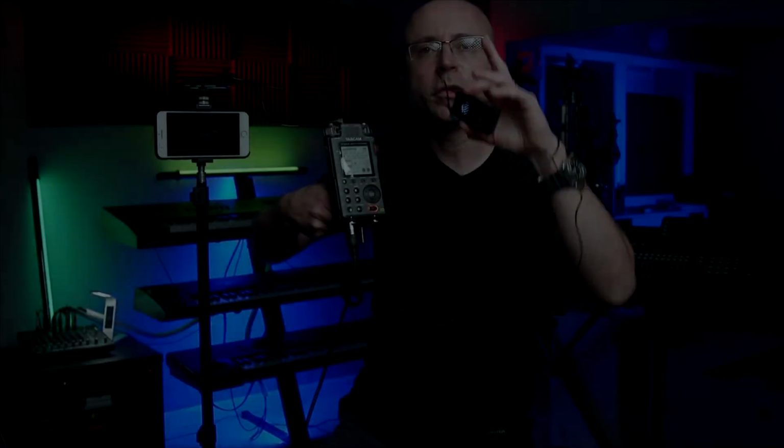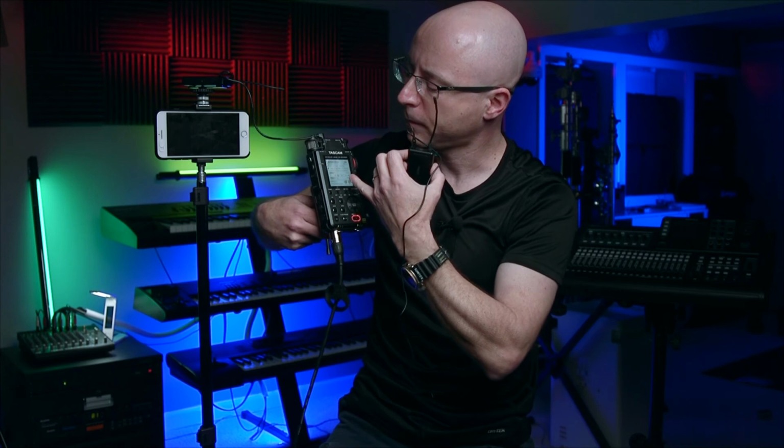Don't know. So with this microphone, I had the volume at 25 on this Tascam DR100 Mark II, and this one here is a lot louder, a lot harder than this microphone, even though this one is also a hot microphone. This is a condenser cardioid, super cardioid microphone. So right now I'm at volume 10, and right now I have the gain all the way to 0. Not really 0, but you know what I'm saying. So right now it sounds this way, almost touching the 12. Now pressing the power button quickly, now it's at volume 8. Actually, let's see what volume 10 does. It takes a couple of seconds to update, so this is my voice at volume 10. And then you press the power button again. Let's see, volume 0, it sounds this way.